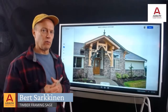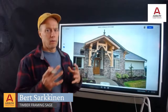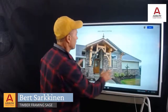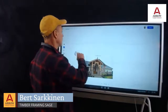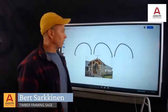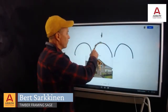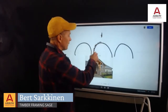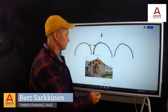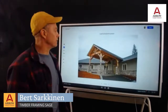And so it kind of goes back to your question, John, with the tie beam and collecting that load. The steeper this is, the less thrust we got out. And it goes to the concept of the Roman arch, with all those aqueducts and bricks, the arch being a real strong deal. Well, you know, the gravity is here, these pieces lock up and the gravity just goes through and that thrust goes to zero and it kind of fights each other there in the middle. And so it's really kind of your basic, once you get it in your head, it's easy to see.